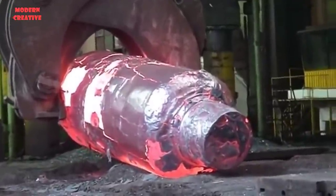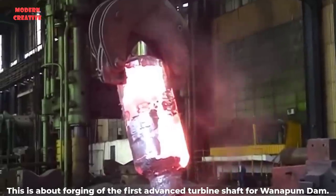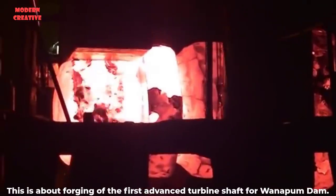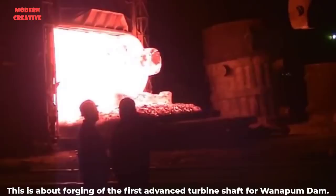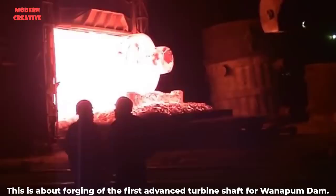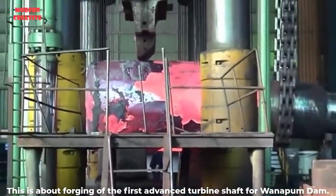Talk about some heat now. That just about roasts you that goes by. And upset the billet twice. It's hot enough now to scarf the flange. Go from there. Before they scarf the entire flange.